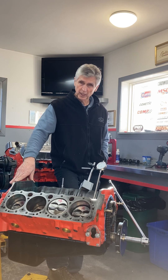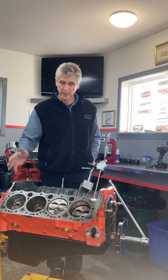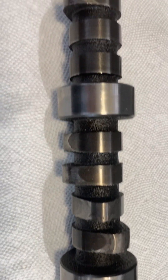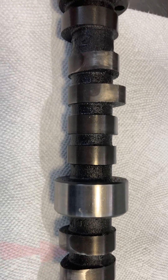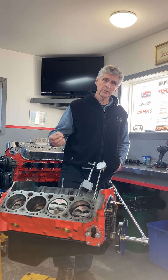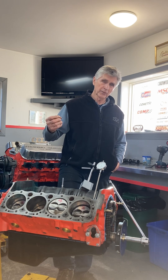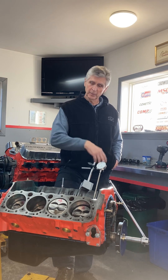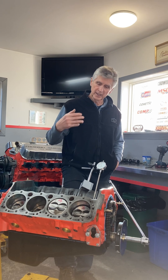The result is it's got to be built again. It had low oil pressure, and once again the camshaft went — pulled the camshaft out and not all of it, some of the lobes are rounding off. A cam failure doesn't just destroy the cam; the clatter damages everything else too. All that shrapnel gets into the oil — yes, you have an oil filter, but it finds its way into the oil.